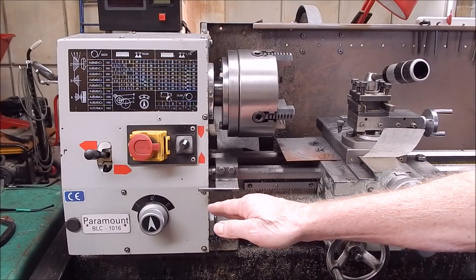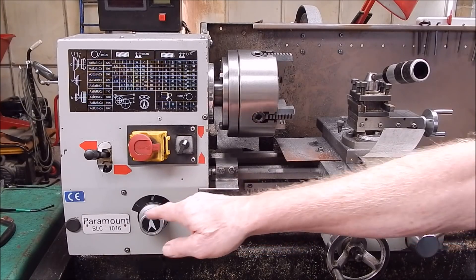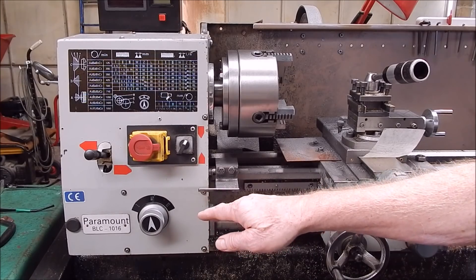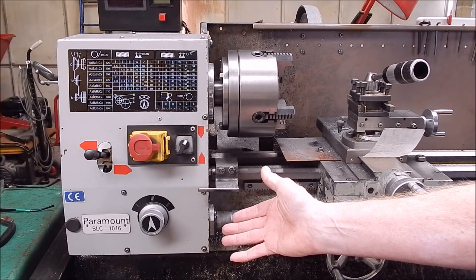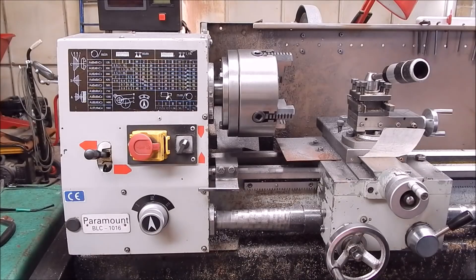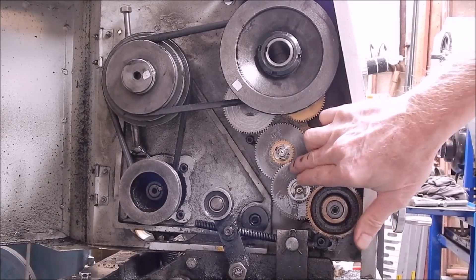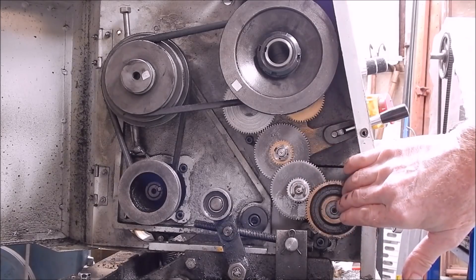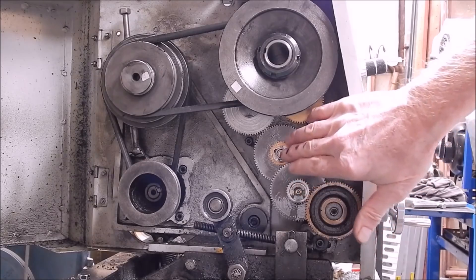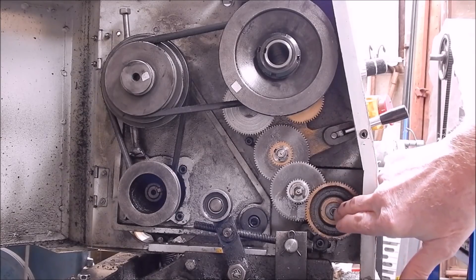So what I want to do for these little boring bars is change the minimum feed rate so I can use them on power feed. All you have to do is have a gear that will lower the feed rate further than the factory's standard setting. I'll show you my change gear train and we'll see what we can do to slow things down even more. Here's your typical change gear train — stepping from the spindle, going from large to small, large to small, stepping through the speed differentials and ratio changes. You're slowing down through each gear set so that finally you're turning at a very slow speed on the lead screw itself.